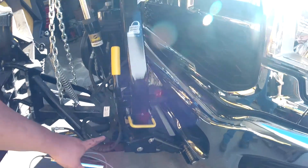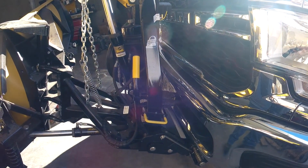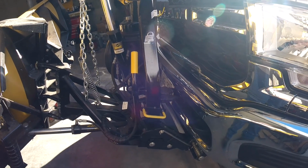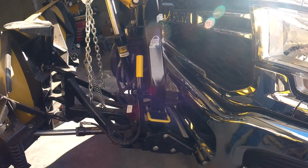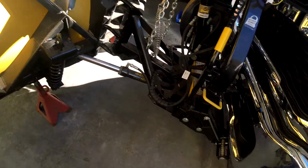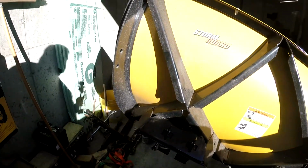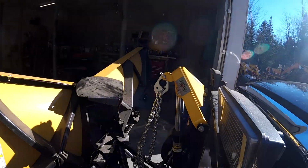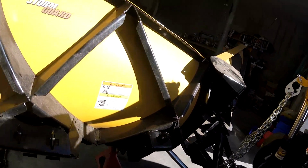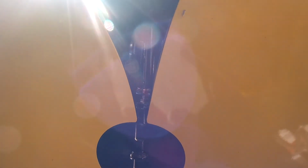Thought it was a little interesting that the lock for the lock lever, when you pull the jack out, it releases that. So you kind of got to pull that lever, put the lock and lever up, then lift your jack. Just little things I got to learn with this new plow. It looks plenty rugged. I'll probably spray some silicone or some grease onto the center piece there, the pivot. In the middle, there's some holes on it. Should take some spraying grease.